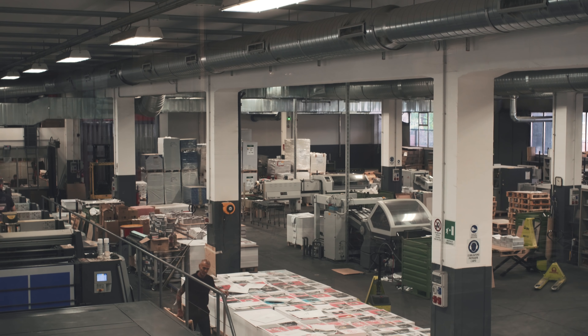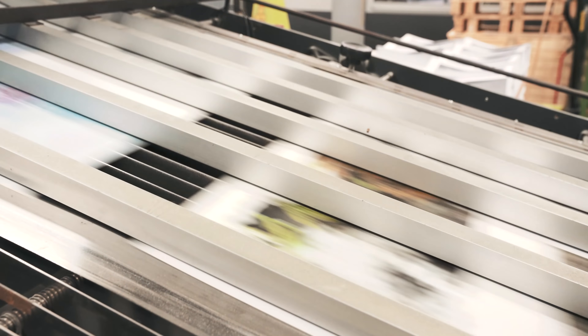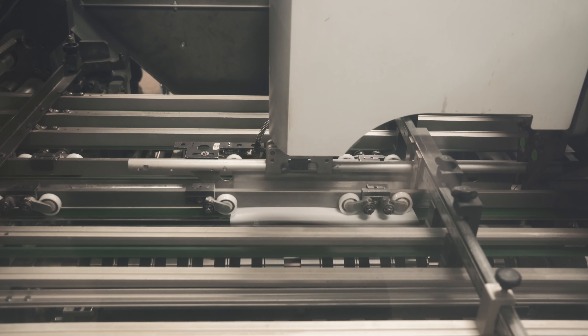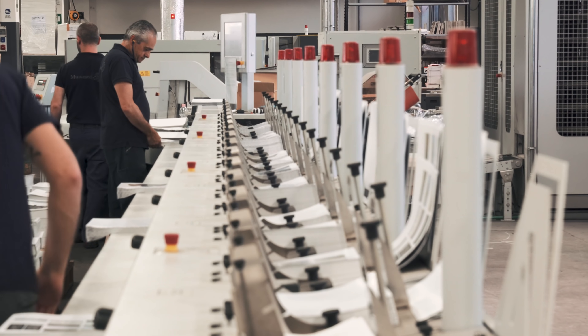So if you're printing photo books you definitely need a really good eye for colour. The sheets of printed paper then get transferred to a different section of the factory where they get folded, and then there's another machine which helps to sequence the folded pages. At that point you're left with these little booklets that kind of resemble the final thing, except they're a bit oversized and have some things that need to be trimmed down. These little booklets then make their way to a separate facility where they get bound together, either by stitching or by gluing, and to ensure the best quality this is done in a separate place to where the printing takes place.